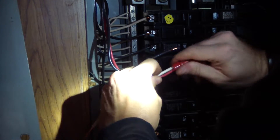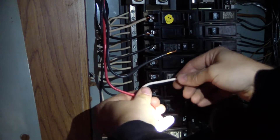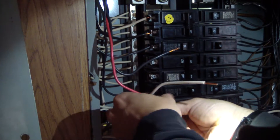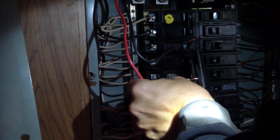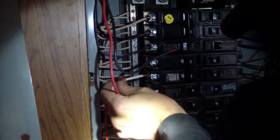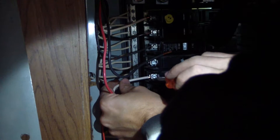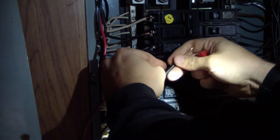I made a mistake putting only two wires together when I needed three - people make mistakes and you have to figure it out. You need the interface wire from the device, the splice wire going to your breaker, and the incoming wire that used to go to your breaker. Wire nut them all together - and they call me the over-taper because I love to use lots of electrical tape. Tighten to the appropriate torque, then always do a pull test. Remember it's a two-pole breaker so you do this twice.